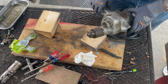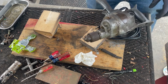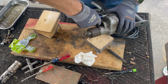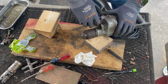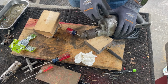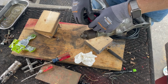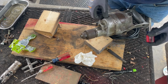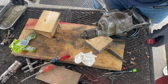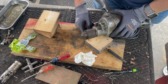So, the other thing is I've got to be very careful when I take this off to not pull the spindle out. It's not a disaster, it just means I've got to take the brushes out. But I have had some experience with older motors that sometimes when you do that, things just get a little unsettled, because this thing has worn in a certain way its whole time. I've seen, mostly on electric fans, that sometimes when you do that, something about how you put it back in and how the bearings sit makes it run hot.